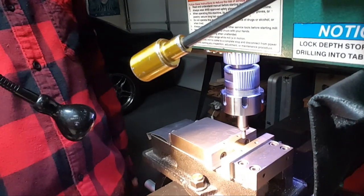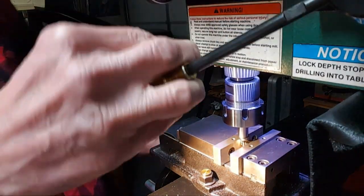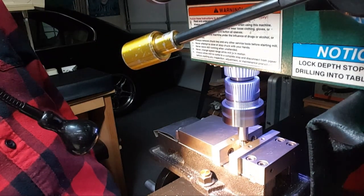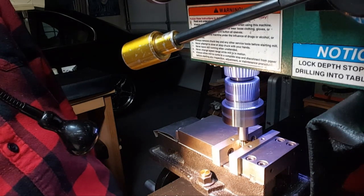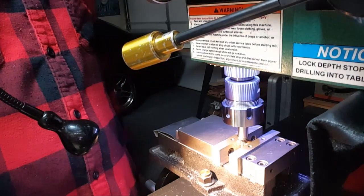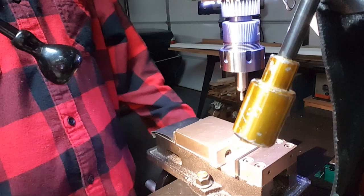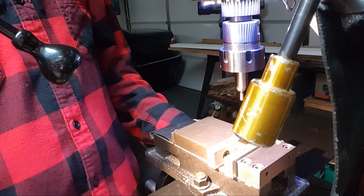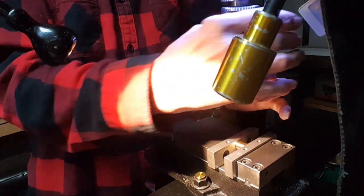Come up, over, back down. Simple work, huh? Come on, trip, there you are. Alright, cut X in half, close that, up a bunch here. Bring it over and lock it. 60, 14, 7, 3, 2, 1, 0. On center. Edge finder comes out.